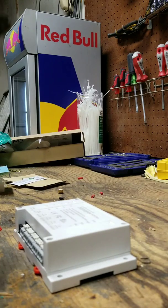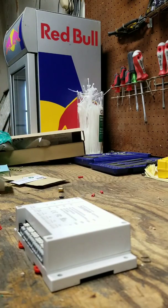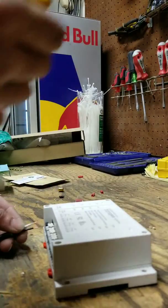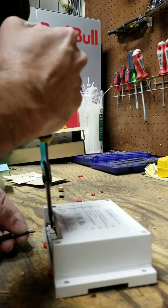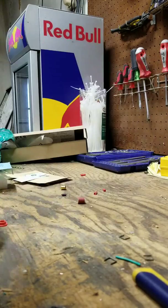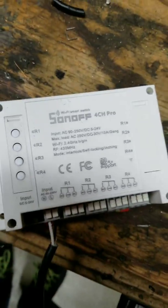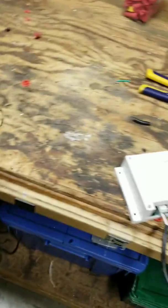You don't really need a big power cord for something like this. According to the manual it takes up to 10 amps DC — I think at 12 volts. Either way, this is AC; it's probably pulling about half an amp tops. Live is black, neutral is white. I'm going to plug this into a working outlet, and then I'll pause the video and come back once it's installed up there.